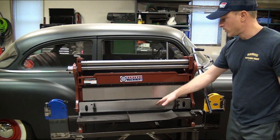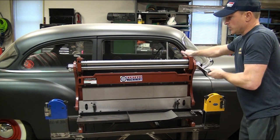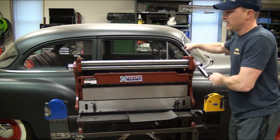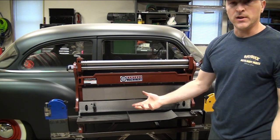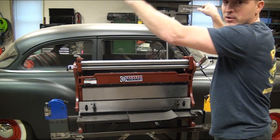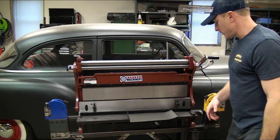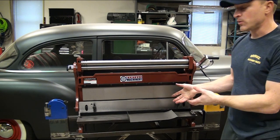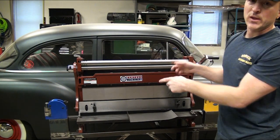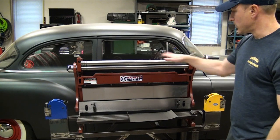This machine works in both directions for the shear and the finger break. If you're more comfortable going up, go that direction; if you're more comfortable going down, just rotate it around. The slip roll only works in one direction. The bottom two functions you can do in either direction — whatever feels more comfortable. You can also put the bar on the other side, or get a secondary bar and pull both down at the same time for more force on the shear. For the break you really don't need a lot of force, but for the shear you do. Just make sure when you get it that you make your adjustments on top for the metal thickness, and your adjustments on the back — because if those back adjusters aren't set, the material will either not feed in or pass straight through without any curvature.